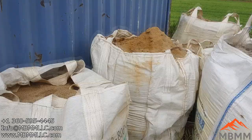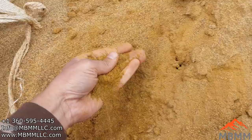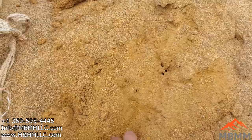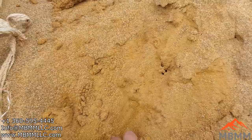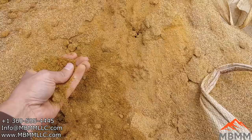I've got several sacks here of these tailings, and this is stuff that has all been through our turnkey system. This is the stuff that the spiral classifier has — the larger stuff that didn't float out of the spiral classifier into the tailings pond with the water. Most of this is going to be larger than 200 mesh. The hammer mill crushes about 70% passing 30 mesh, and about 50% passing 50 mesh. So I'm hoping that we can take this stuff and grind it up and liberate some more gold.